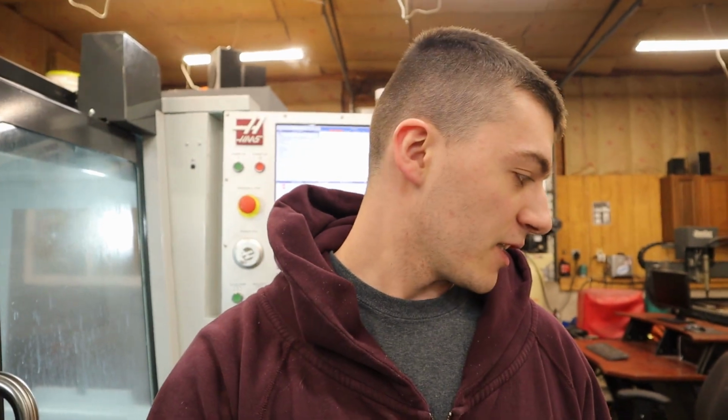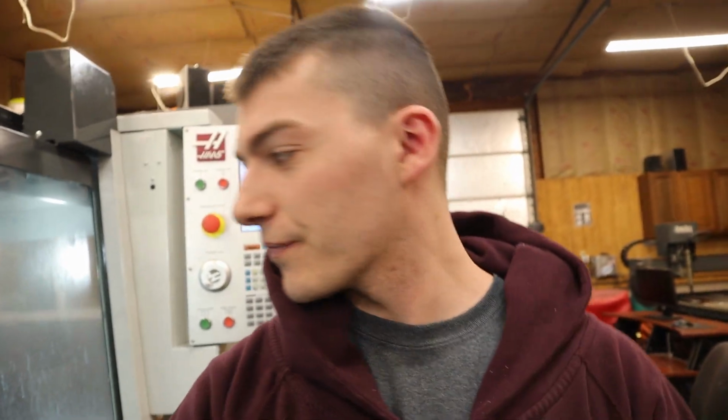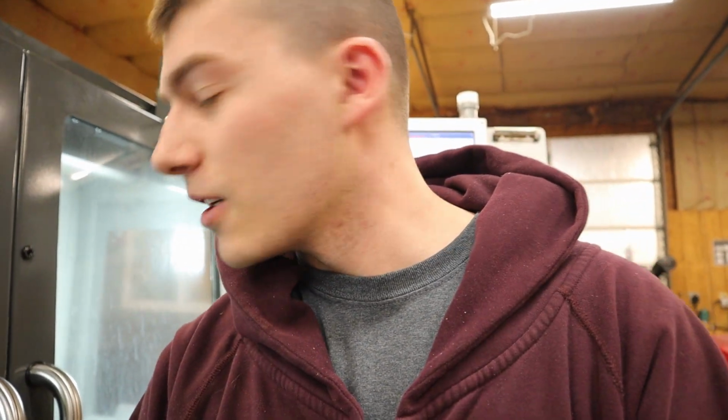So what basically happened was, oh, you guys don't fit under there. The work offset was set to 1, which is G54, and I was using G55. So that just goes to show you that you should probably pay attention when you're posting stuff out. Oh well, there are a couple of issues with this one anyway, so that gives me an opportunity to redo them on the next one, which will now be the 4th time.